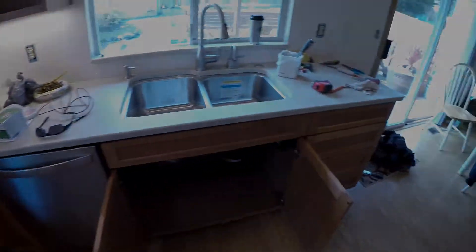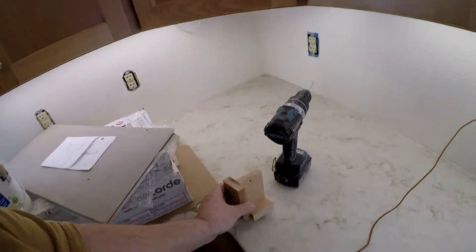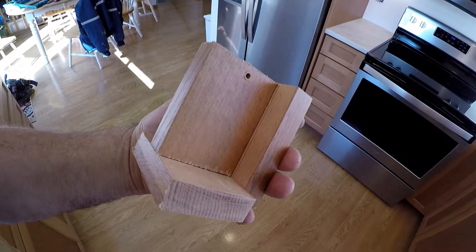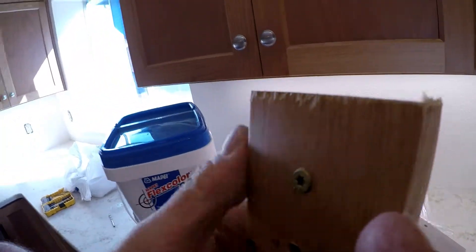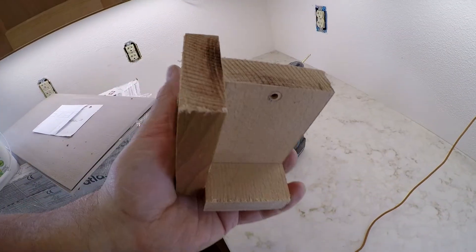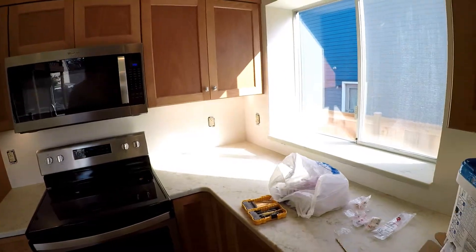Alright, let's get going. We're installing knobs on the cabinet doors, and the way we're doing that is with a jig made up here — three pieces of wood. There's a left side and a right side. The left side fits on right like that, you hold it on and drill your hole. For the right side, you just flip it around and drill your hole. You have to make sure these are all square to each other for this to work properly, so the knobs are all the same and equal left or right.